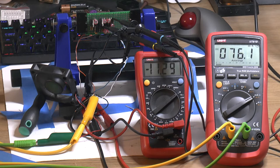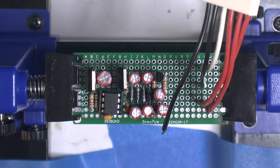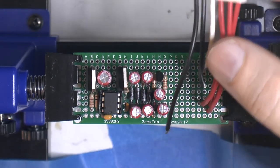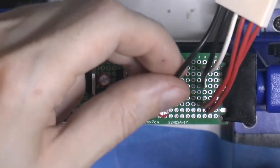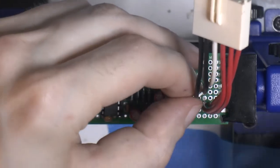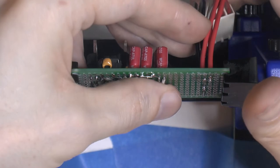What's left to do is hook up the Molex cables and the AT connector, and add some fasteners to the support bracket at the rear so we can mount it. I'm going to do two AT connectors and a couple of Molex connectors. The reason I didn't go with surface-mounted connectors was because the cables from the power supply won't reach anyway, so I'd need extensions. Instead I got some extra length of cable from the actual card. Seems to be the easiest way to go.